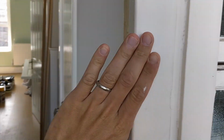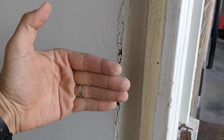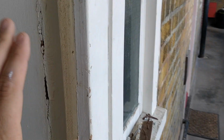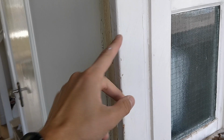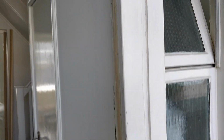Okay, so the next step is to sand this frame down. What I'm going to do is feather the edge of this a little bit. I'm going to put the plane on it and then sand it down, because I'm bringing the inside frame in, so this outside frame also needs to come in, and I want to blend the two from the new frame to the old frame. There's this little round over here, so I've got this much to blend, which isn't a problem, I can take that off.